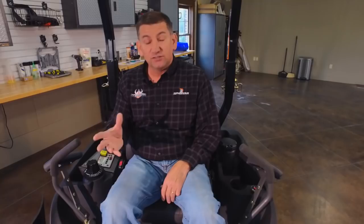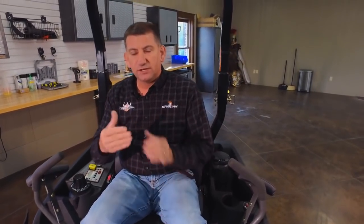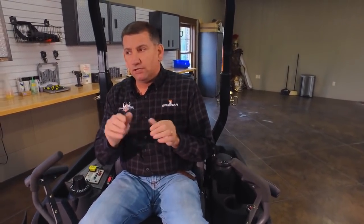And we use really, really large pulleys. So the pulleys on this machine, every deck we have has 6 3/4 pulleys on them. So they're 6 3/4 diameter. What happens when you do that is when your belt goes around the pulley, it doesn't stretch your belt. Because if you've got a small pulley, when it bends around it, then it can eventually, after a period of time, just start cracking your belt. So we're extremely excited to have these, to get our belts where they run at ambient heat.